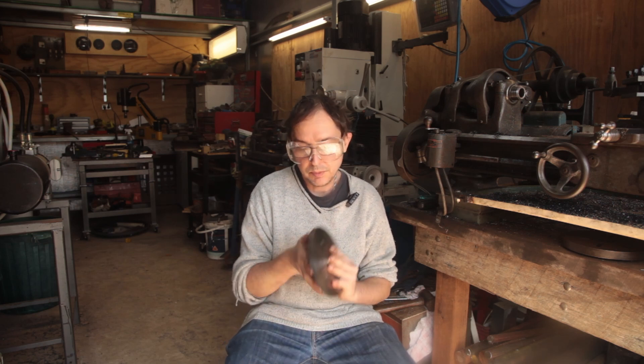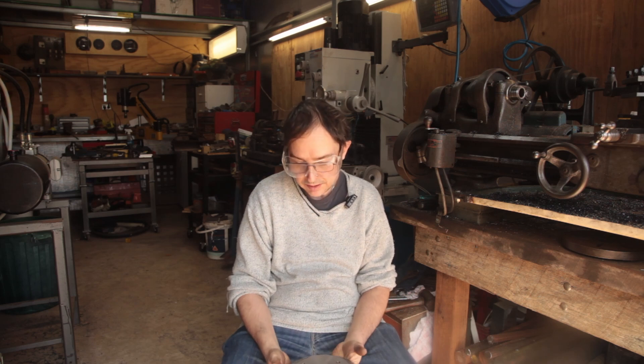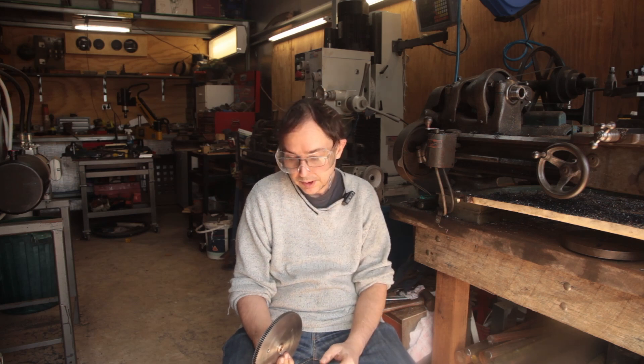We need a banjo because for some of the threads there isn't clearance between this gear and the lead screw spindle. So you need an idler gear in there just to make things fit. But that should be in the mail on Monday, so next weekend we should be able to make a bit more progress on the other projects, and we'll see how we're going.